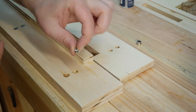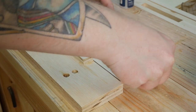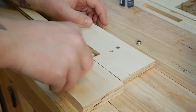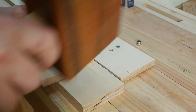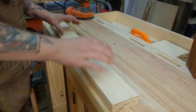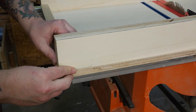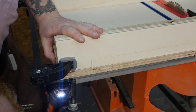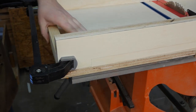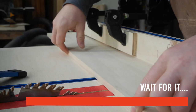A good trick when installing magnets is to group them in pairs — place one, then flip the other and place it. This way you don't mix up the polarities and rip a hole in spacetime. Using a spacer to keep the two fences parallel, I attach the back fence by screwing into the three-quarter inch plywood from underneath. This extension arm lengthens the capacity of the sled and its repeatability a good amount.